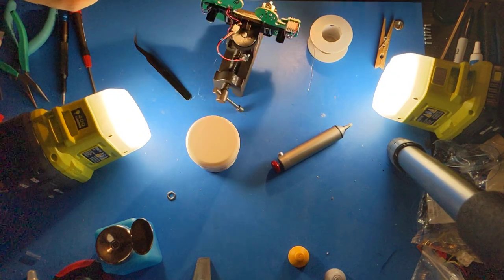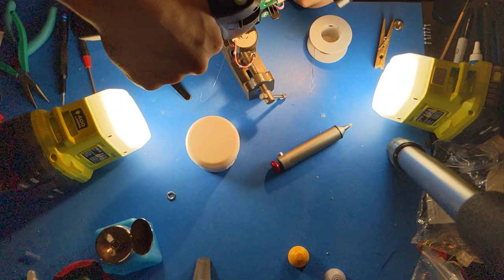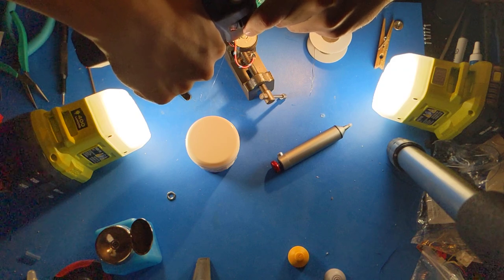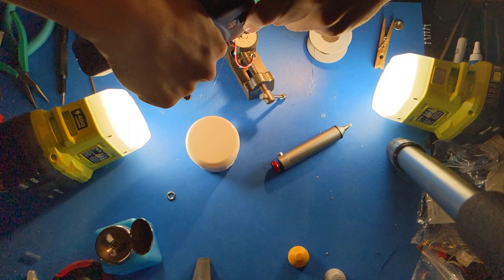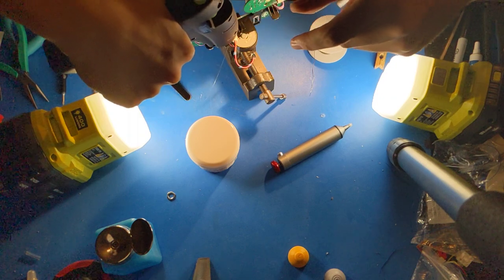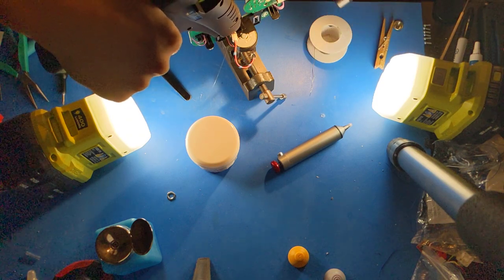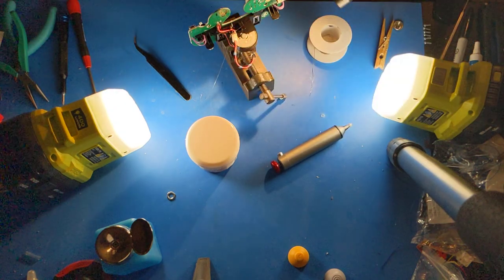It's very important to fill from the pins all the way to the bottom of the rumble bracket. Otherwise, when you insert the JST, it pushes the pins down and the pins can pop out of the back of the plug. The other thing to keep in mind is don't let it get too tall. Like in the current orientation, you don't want to get too far from the rumble motor, or else it will not fit into the shell.